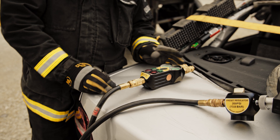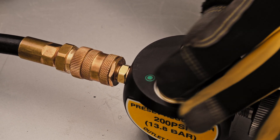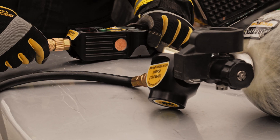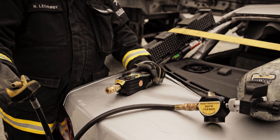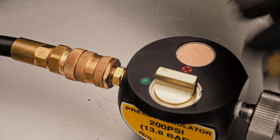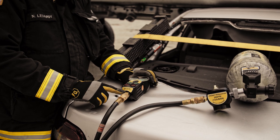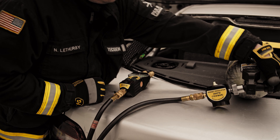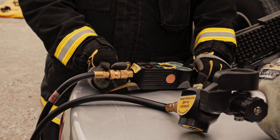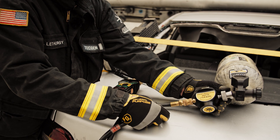Takedown. To release the air pressure from the inlet side of your controller back to your air cylinder safely: one way is to just shut off the valve on the regulator, turn the collar on your safety coupling — it releases the air pressure from the hose and you can take it off. Then close your air cylinder, just open up the valve, and it takes the air pressure from that side of your regulator. The other option to de-energize from your controller to your air cylinder is to shut off your air cylinder. Make sure your valve is in line. Unscrew the safety coupling, then it de-energizes all the way to the air cylinder.